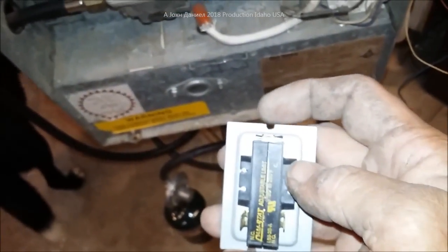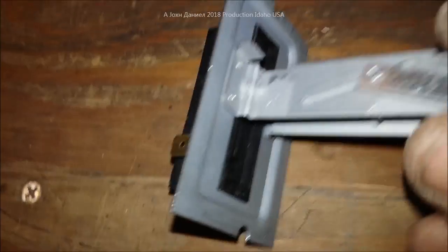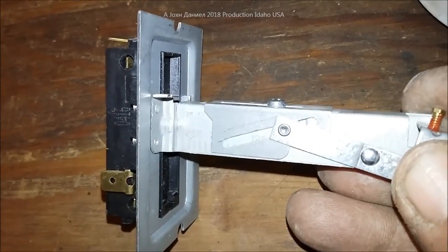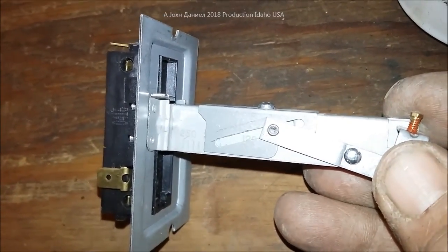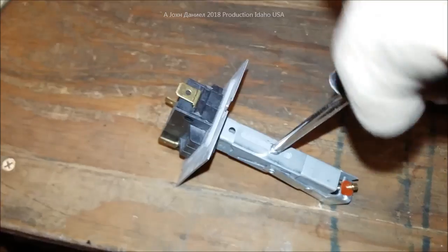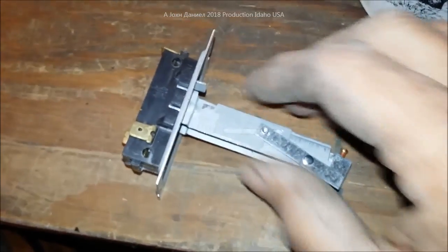I'll show you a close-up of what the heat exchanger looks like inside — it's just a set of heavy steel cans that's where the heat goes through the air handler and gets pulled out into your system. Now with this removed, we're going to take the other one and you can see how it's got one offset side — they generally always have an offset side — and there's a screw that holds it in. There's no gas inside of here; this is just where the hot air is made. We want to set this for 200 degrees, and it shows you at 250 right now, currently at about 225, so we don't want that.